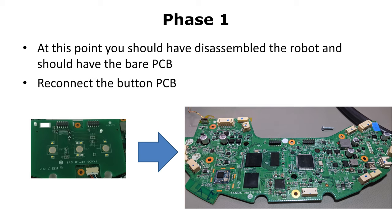Now you need to type those two commands — you can copy and paste them from the document in the description. The first command loads the obfuscated root password into memory, and the second one prints that area of memory. If you have a second person holding the wires, you can release them now after you have sent the second command. Copy the marked string from the output — this is the obfuscated root password of your vacuum cleaning robot. Go to my website, paste the string there, and this will deobfuscate the string and return the root password.